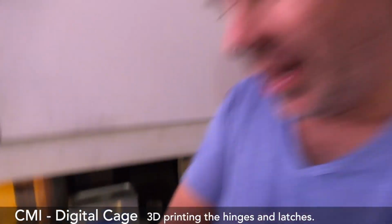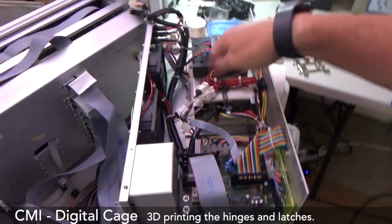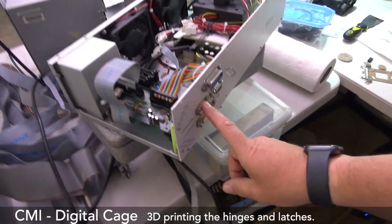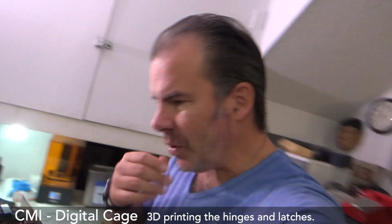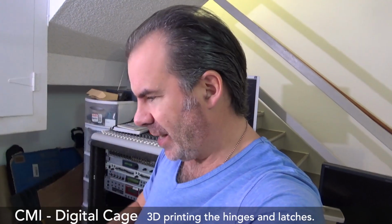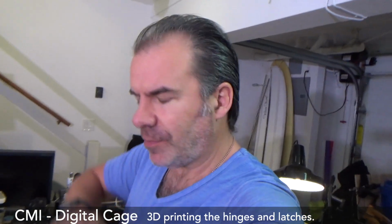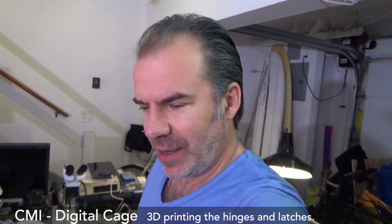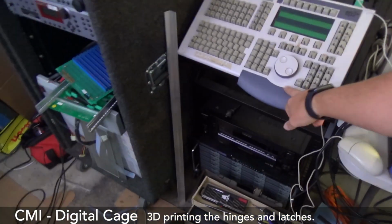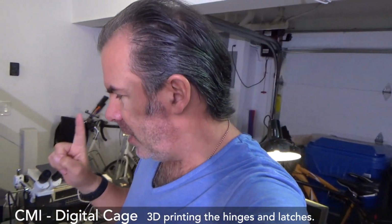What else I'm doing at the moment is I've taken this all apart again. I'm going to be adding another 15 or 18 volts onto the 354 card so that it puts out the right voltage. This will do two things. One, it would probably power the Fairlight Alpha, the pre-keyboard, if I was going to connect that. But also, I'm getting one of the little boxes that allows you to connect a normal USB keyboard and mouse. Right now, I need to get into the menu system of this, apparently Andre tells me, so that I can switch on mouse support. Because right now I'm not seeing anything.